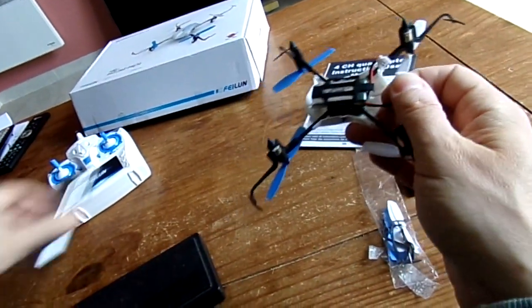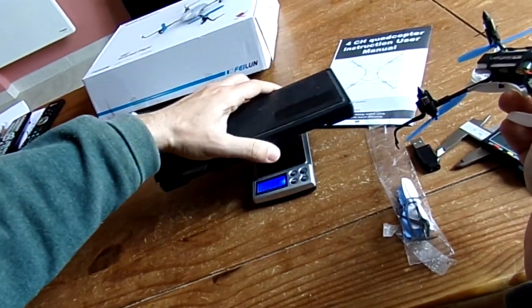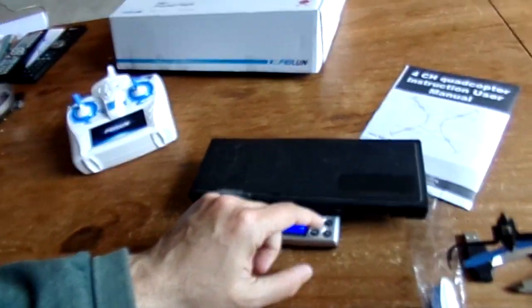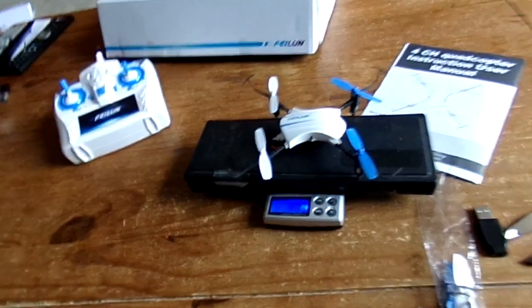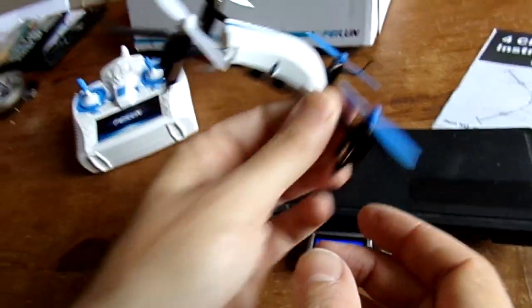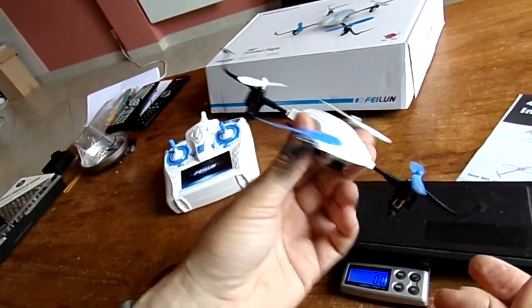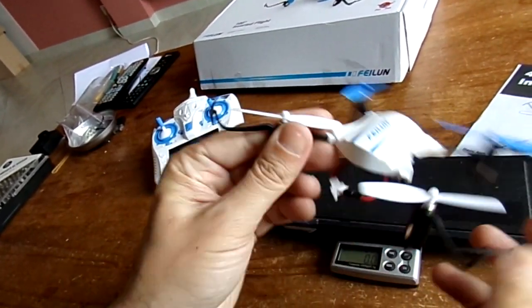Okay, I will use this box as a stand. You will see that this quadcopter with a LiPo scales something like 40 grams, and you can remove 1 gram if you remove the prop guard. So it's pretty light for 7 millimeters by 20 millimeters coreless motors. So you will have a good power at least.